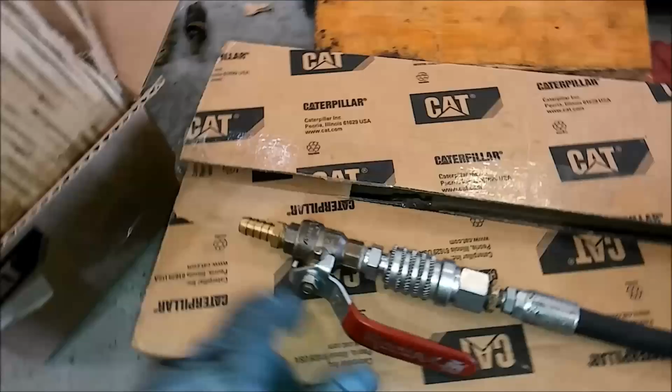And that's the best place to get fuel from. Now, you can see from that video, the reason you don't want to fill from the center is because the center is the clean side of the filter. On pretty much all filters, they fill from the outside, and then the clean fluids go in from the center. So when you're filling from the center, even though it's a clean source of oil or fuel, you're potentially installing contaminants or debris on the clean side of that.